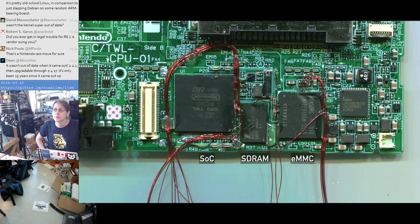I used that technique to figure out enough of the partition table to figure out where some of the interesting areas were, and I could also use the access patterns. So I figured out the partition tables and where the interesting binaries were, and where I could actually write to from applications. For example, I could take photos, and those photos would be written to the eMMC. So I was imagining, could I get the photo-taking application, if I could stream just the right data into the camera, to write that data with the right encryption key to the wrong location and then overwrite some of the code in the bootloader? Or not the bootloader necessarily, but the main menu. That didn't end up working, but I had fun investigating that.